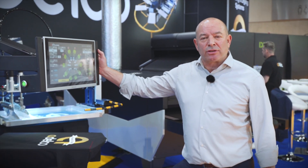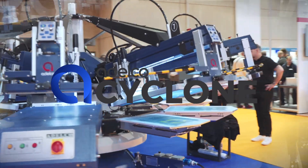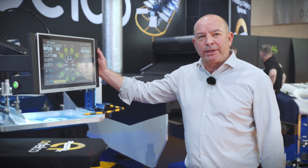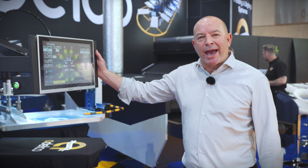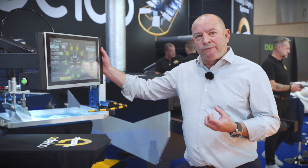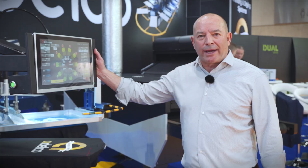I am pleased to introduce you to our latest Cyclone automatic textile printing carousel, available in three different print formats: 45 by 50 centimetres, 50 by 70 centimetres, and 60 by 80 centimetres. The machine can be built up to 14 colours and 16 stations in any of those formats.